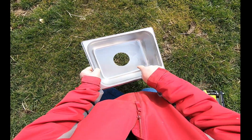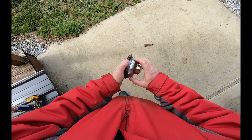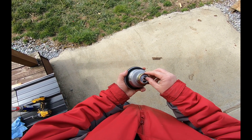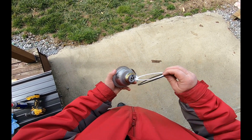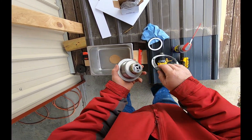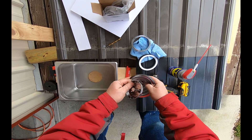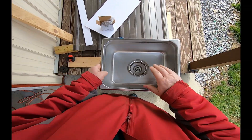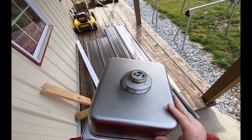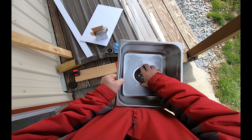It didn't misform it or anything. Now I just hope my drain fits in the bottom. I'll take that nut off. There's the rubber gasket and a piece of cardboard — that's a cardboard gasket, don't lose that. That keeps your rubber from scrunching up when you tighten the nut back down. Let's see if it fits. A three-and-a-half-inch hole works perfectly for that. And it's not going to leave much of a lip there at all.